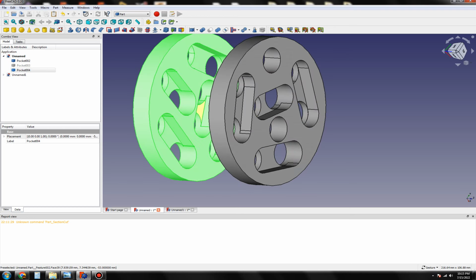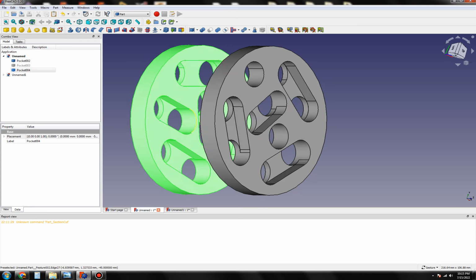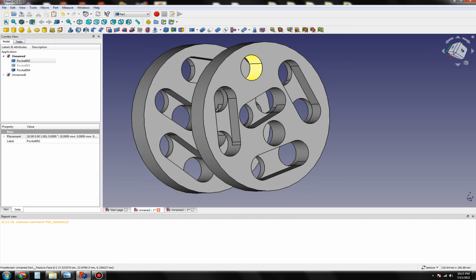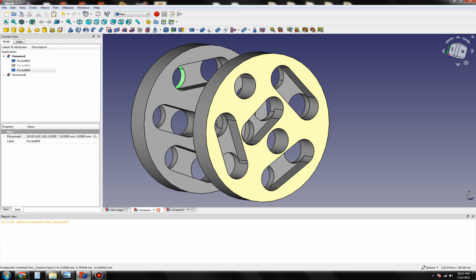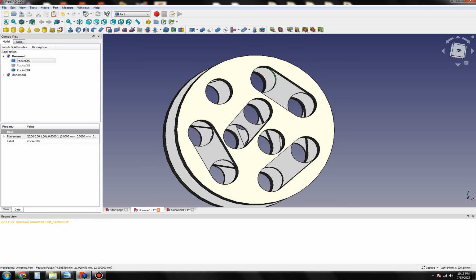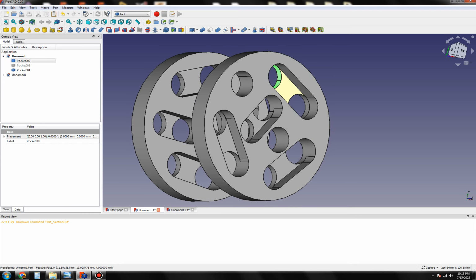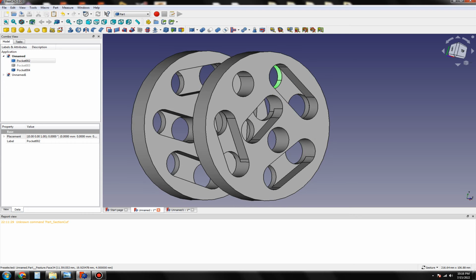That would be this ring. Now this ring will not be facing the way it's facing, it'll be facing outward. But the point is, I wanted you to see what it's actually doing. So if you have a pipe from this hole to this hole, it will force the water through to this hole and then back out to this hole, and so on. And it will force the water to keep going in one direction until it goes through all of the pipes, until it comes out. The reason I did that was to try to maximize the heating efficiency.